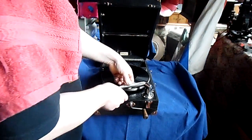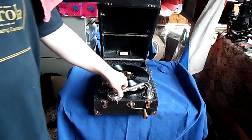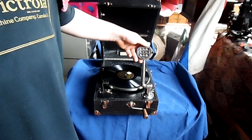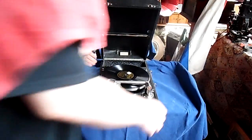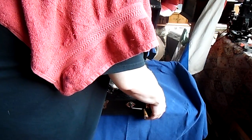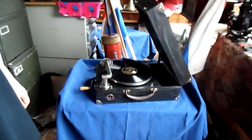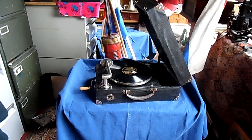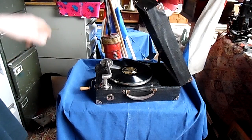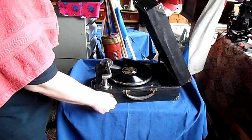Let's put it back on its pedestal. This little thing here fits perfectly into this slot — you put it down like that, it fits in, doesn't go anywhere. That's very nice and something you really don't find on other gramophones. With a tone arm you always have to put it all the way in the back and click it into something, which is fiddly and breaks — but with this you simply lay it on there and it's fixed.